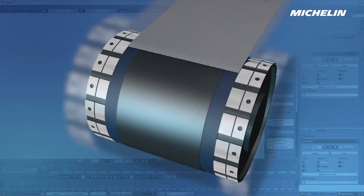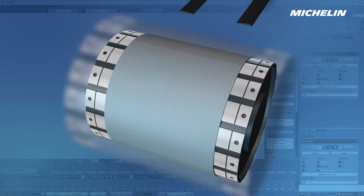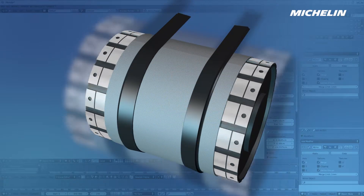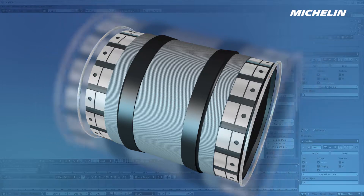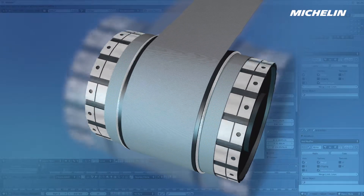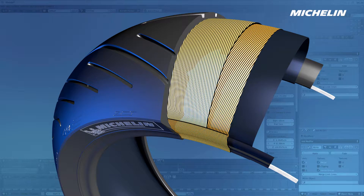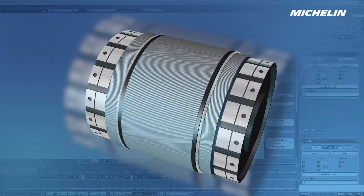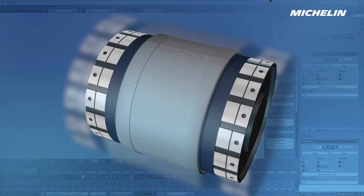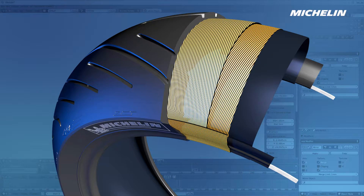Next, a ply of rubber-coated textile cord is added. Extruded rubber bead fillers are installed on either side to accommodate the bead wire. Metal hoops are used to clamp the tyre firmly against the wheel rim. A second ply is put into position in conjunction with the previous ply — they constitute the radial carcass of the tyre. The first ply is folded down onto the beads to anchor it firmly. Two extruded profiles of resistant and flexible rubber are added, which will form the side walls to protect the carcass from side impact.